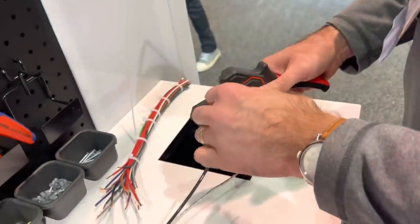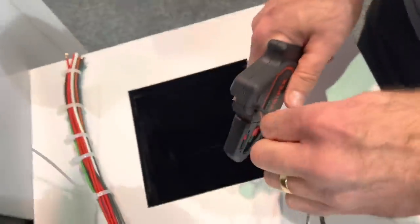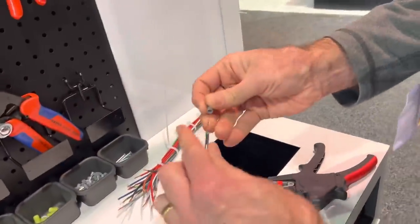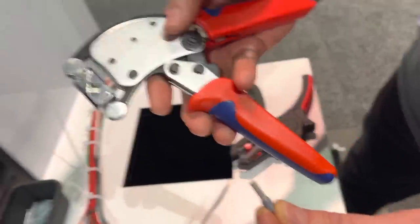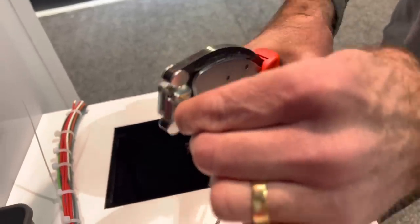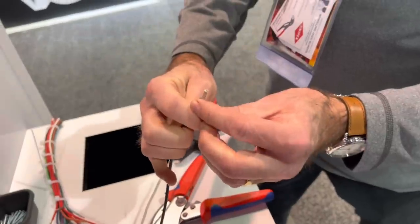So I'm going to cut this off — I'm using household 12-gauge wire, it's a lot easier to use — and then I'm going to strip off a little bit. Now I'm going to take my end ferrule and just place it on the stripped wire. I want the wires just about even with the end of the barrel. I like using this tool — part number 97-53-18, also called the Twister. All I have to do is stick the barrel in the die, squeeze the handle, let it go. Done deal. Nice, perfect crimp.